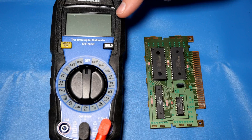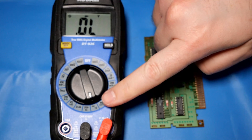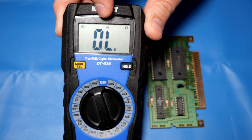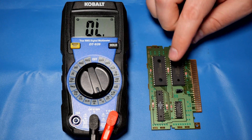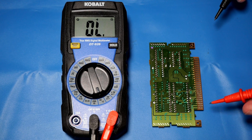So we have our multimeter here. What we're going to do is set it on continuity test mode. We'll turn the dial over to this section — we have to press mode — and you have a little symbol up here that looks kind of like a sideways wifi symbol. Just because we can see a little better where the leads go, we'll start with the side and do a quick test.